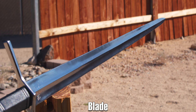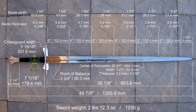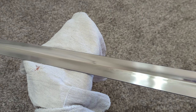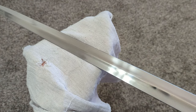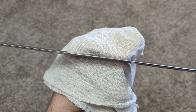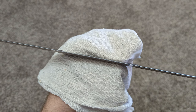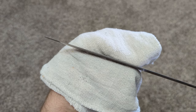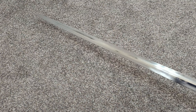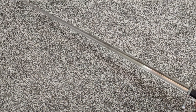Now it's time to talk about the business end — the blade. This is a very long blade at just over 39 inches. It starts at a little over 1.8 inches wide and has a gentle and even profile taper for most of the blade before transitioning into the ogive curve of the tip. The blade is 6.3 millimeters thick at the guard with interesting distal taper: for the first 6 inches it tapers about half a millimeter, but then the next 6 inches it drops a full millimeter, before slowing to a more even reduction, ending at 2.8 millimeters at 36 inches up the blade.